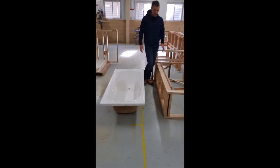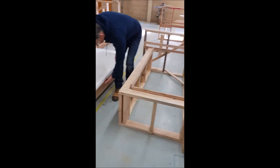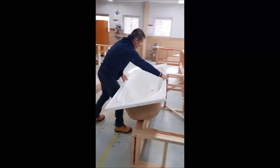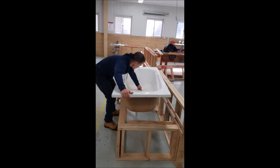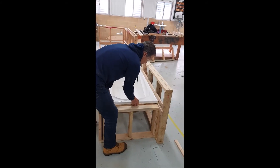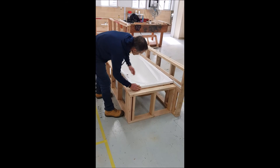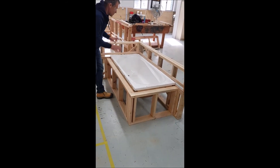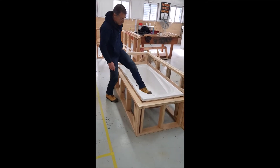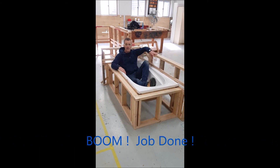We're back for the final install. I'll just put a bit of a chamfer on those supporting rails just to make sure that they don't foul up on the rounded part of the bath. And now this preformed bath can go in — I'm just going to shuffle it in. Just be careful on the back there, and make sure it's sitting on. With it being held up against that lip there, it provides just a little bit of a margin at the back to be able to have some adhesive or silicone to support that so the bath doesn't creep. Once the plumber installs it and possibly muds it up underneath — there you have a bath.